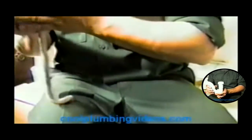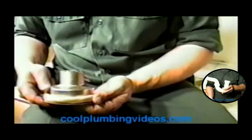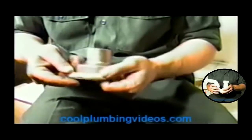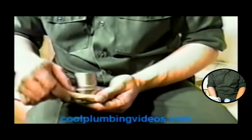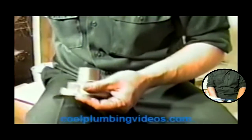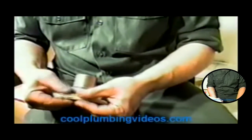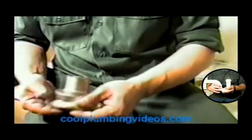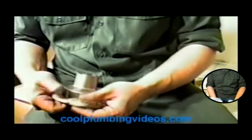What we'll do is take it — as you can see, I'm smushing it out just like Play-Doh. Then I'll take the basket strainer here, take the putty and go around the top of the basket strainer. Now we're at the other end. This excess we'll just kind of trim off and put the rest back. Kind of smoosh down on it a little bit so it'll stay in place when you go to flip it over and squish it down into the hole of the sink.